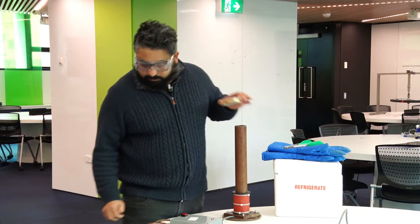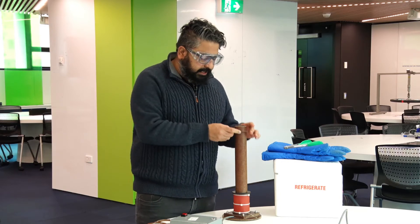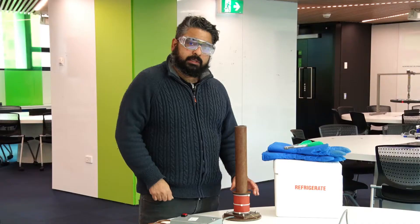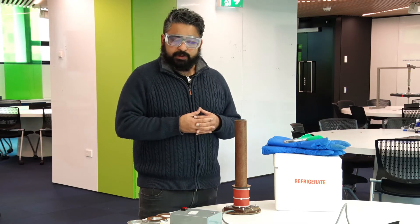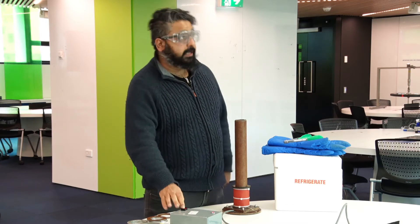So there it is — the two LEDs have gone off. What happens is when the current runs through the solenoid, it induces a magnetic field, which is initially zero and then increases. As it increases, the second ring, which is not attached to the solenoid — there's a rubber ring here to isolate them electrically — will see that change in magnetic field and will want to resist it. In order to resist the magnetic field, it will induce a current in the opposite direction, which will induce a magnetic field in the opposite direction. So it will be very much like bringing two magnets of the same polarity towards each other — they're going to repel each other.